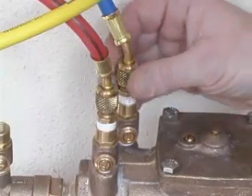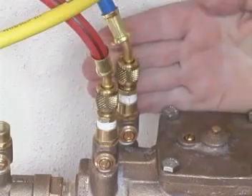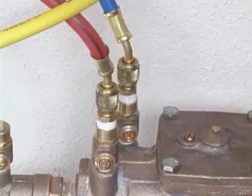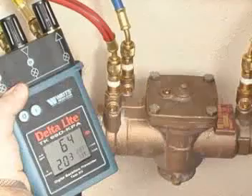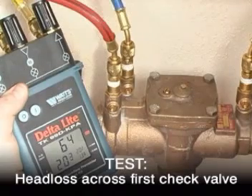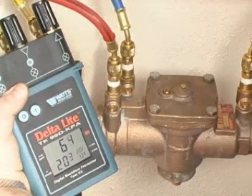To compensate for any seat compression, loosen and tighten the hose on test cock 2. If the gauge remains steady, then the second check valve is holding tight and should be recorded. Now observe the differential pressure gauge reading and record the figure. This is the head loss across the first valve. It is important to ensure that the buffer — which is the difference between the opening point of the relief valve and the head loss across the first check — is greater than 0.2 bar.